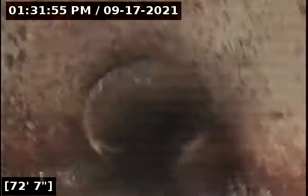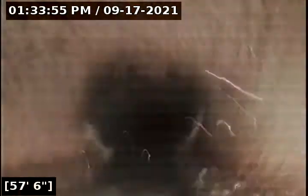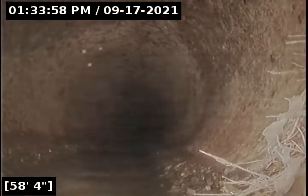My instrumentation is a little off, so I'm going to try to locate from right there. I've located this section and marked it out, so this is going towards the west street. I'm thinking that was the first root intrusion we found at 58 feet. I'm going to go mark that as well. I've located this as well and marked it at 58 feet.